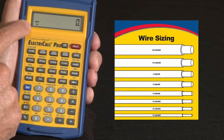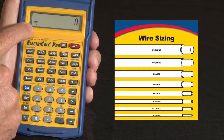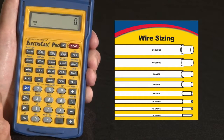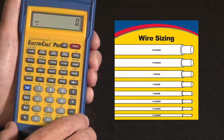It also shows you a couple of the other defaults in the calculator that are always here. First off, it's 3-phase as a default. Copper wiring, 60° C insulation rating. There's also a default for the ambient temperature, which is set for 30° C, and that it's in a raceway mode as opposed to free air, so it's working off a table 310/16. So now we just enter in some volts and some amps, and we'll do some wire sizing.